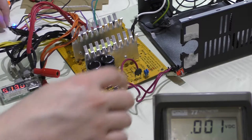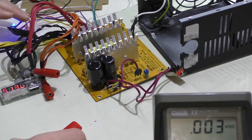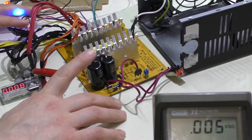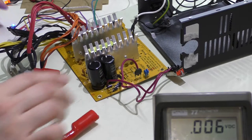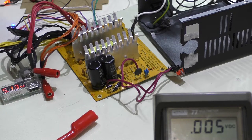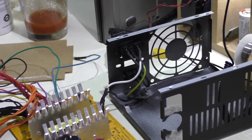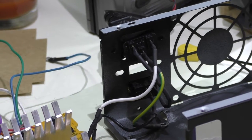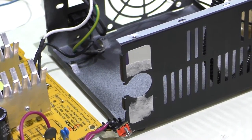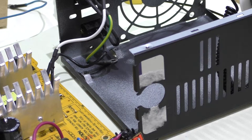So all it was was that switch. I'm going to disconnect this and let the AC voltage dissipate from the caps — touching the other side of those could be quite painful if not deadly, so we'll be very careful. Now that we know this is operating at the proper voltages, once I correct that switch, we're going to focus attention on the AC lines — disconnect the old ones, measure out some new ones, and get the hole prepared for the relocated USB. I won't be able to paint this right away because it's kind of cold out.